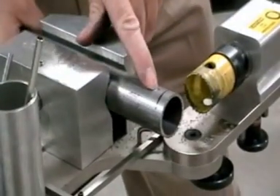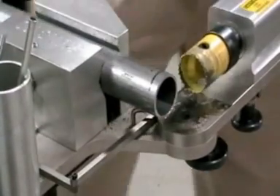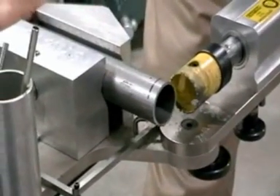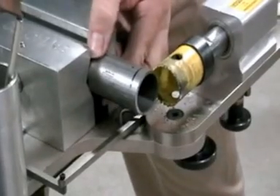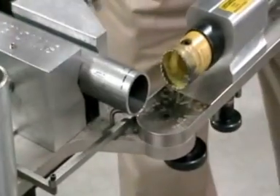This is my mark — top center — and I can eyeball that pretty good, right there. We have that centerline finder if you need to put it on there to know exactly where it is. Now we'll go ahead and line this up here, edge of the hole slot to that mark, make sure we're top end center, crank her down, everything's tight, and we're ready to go.